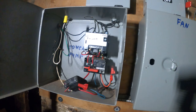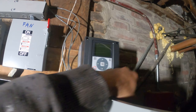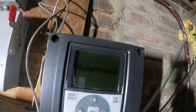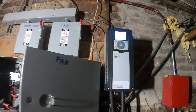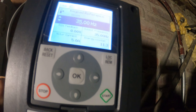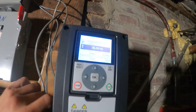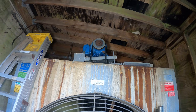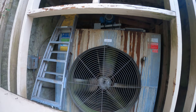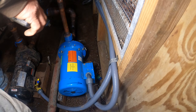Here's the setup — that's for the tower pump, here's for the fans. Turned the power on and let the VFD start. Clicked start — motor current is 5.7 amps, 5.1 amps. The fan is running, but if you look at the belt it's shaking — it's worn out and has to be replaced. But we're running. We came here to finish the piping and make sure these pumps work, and we're good on our side.